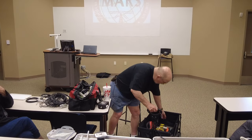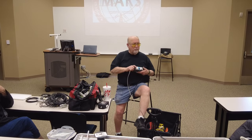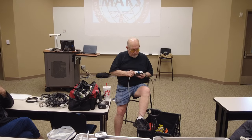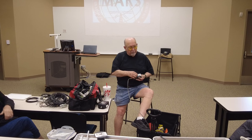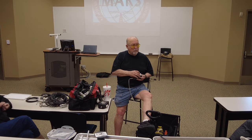You don't have to have an antenna analyzer. You can buy one of these off eBay for 10, 15 bucks. And it's real simple. You can transmit on low power. Once you get it up, you look at the SWR. If it's high, I'm going to change frequency. I'll start at the middle of the band and go up to the top edge of the band and see what the SWR is. If the SWR goes down, then I've cut it short, because it's resonant short.